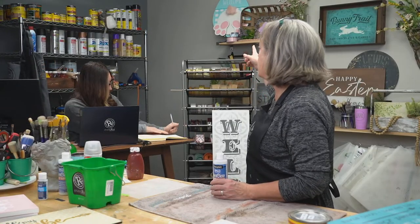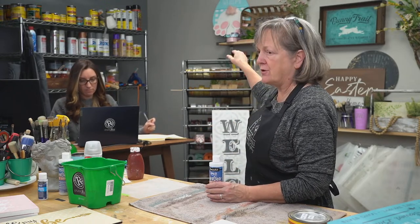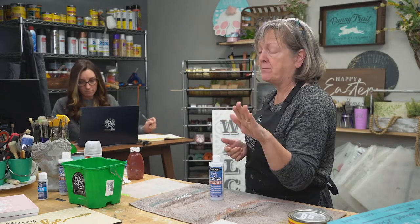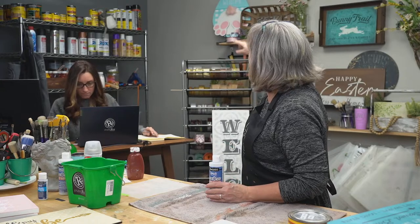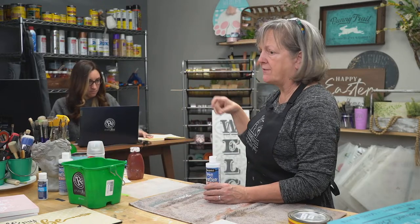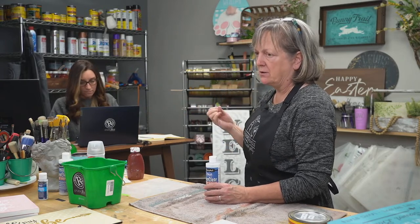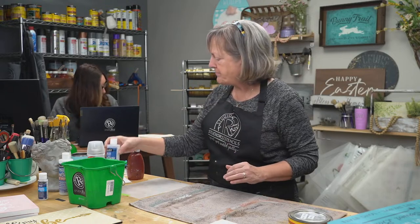Before you glue on the tail, this is a whole other thing. I'm really glad for this question. If I'm doing this project, I don't want to varnish it before I start gluing it together, because the varnish impacts the glue, and it might not stick. Now, you can find some glues that do stick. But what I would do is not put on my tail yet. I would take it glued together outside and give it a little spray with this, maybe two or three coats, in different directions, this way and then this way, and then I would get a good sticking glue and put my tail on. So that's really nice for 3D surfaces. Really, really nice. I hope I answered that question.